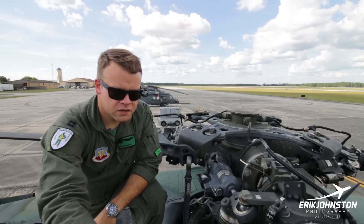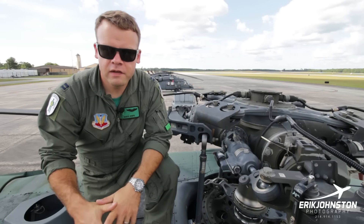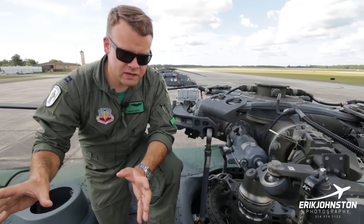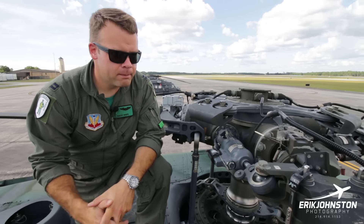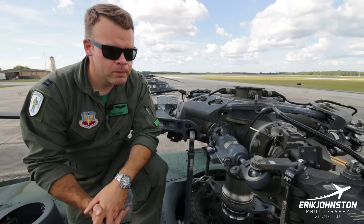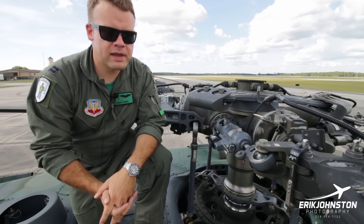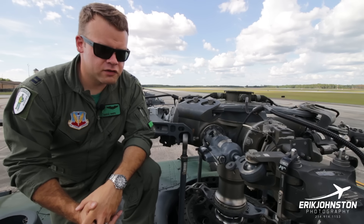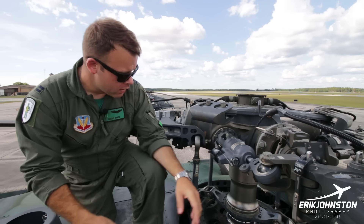The main difference between that and the engines is that the engines use anti-ice — no ice is supposed to build up — whereas the blades allow some build-up before shedding, and how much ice is building up determines the timing and duration of the blade de-ice system turning on. Just like airplanes, you don't want ice changing the shape of the airfoil. As ice builds up on rotor blades, it makes them less efficient and increases torque, causing vibrations in the controls and throughout the helicopter.